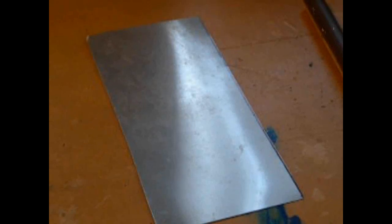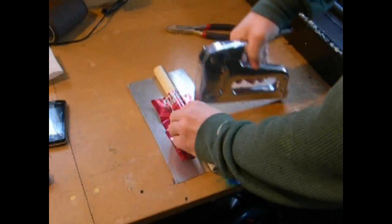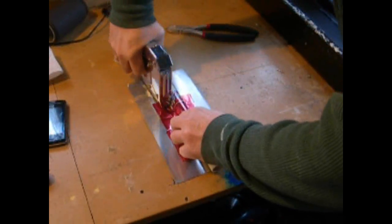Maybe I'll take it down to the lake and test it. I thought I'd also make another one — the more normal flat-panel type that people make — using PVC in this one too. I'm using three-quarter inch because I had some laying around so I didn't have to buy anything but connectors. I laid it in a box with metal flashing as a background, and I used pieces of pop can put down over the pipe as flashing to draw the heat. I know PVC isn't the best, but copper is too expensive just to play around with, and I don't get enough sun here.